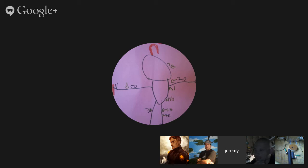Well, I think my personal belief in a lot of that is it's really important what the dielectric is, because that's where your charge is being stored. So if your dielectric matches up with your conductive material, in that your charge can pass through but not penetrate or interact with the dielectric, or the two field presences on either side, that's where you get your supercapacitors and stuff like that. That's why the electrolyte is so important. And then surface area is important and all that stuff.